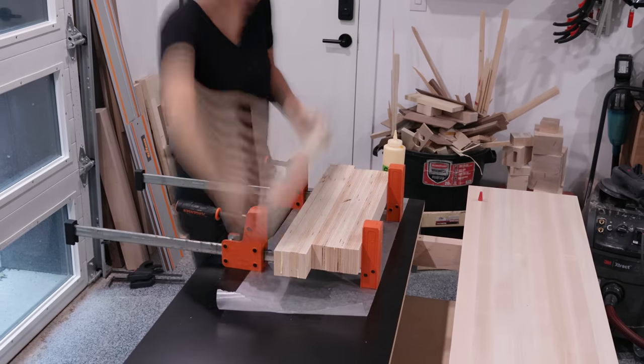I wanted to add a row of dog holes in line with the center of the vise, but realized drilling all the way through would interfere with the actual vise. So I did something really fun — I made pop-up dogs, or as one of my Instagram followers said, prairie dogs. These are made from three-quarter inch dowels that I made from scrap walnut. I milled a piece to three-quarter inch square at the planer, then set up a three-eighths round-over bit at the router table, did some test cuts on all four sides until I got a perfectly round shape, then made the round-over on all four sides to create the dowel.